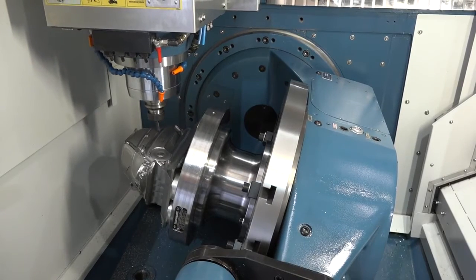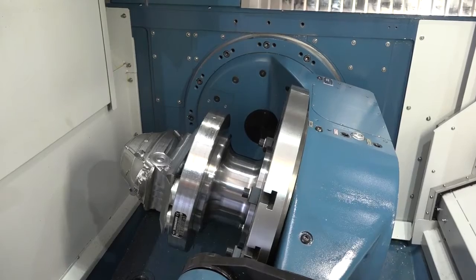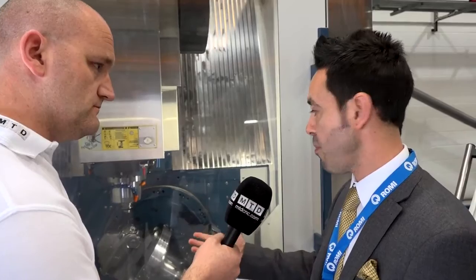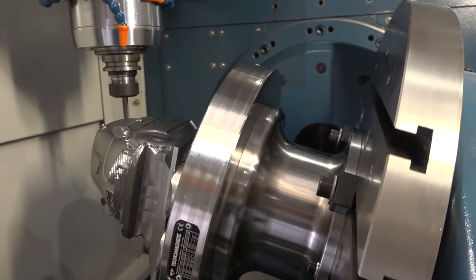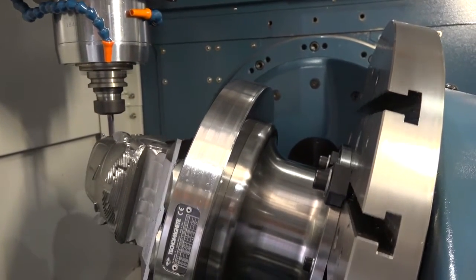These magnets go up to one metre in diameter, so the greater the surface area covered, the greater the clamping force you'll achieve. And this is obviously a five-axis machine — straight away I'm thinking mould and die. It'd be great for those, wouldn't it? Yeah, perfect application for mould and die. But any complex fifth-axis component that's a size above 150 mil square, in my opinion, it's the best solution — saving setup times, cost on additional operations, and it's a clean system with no mechanical clamps.